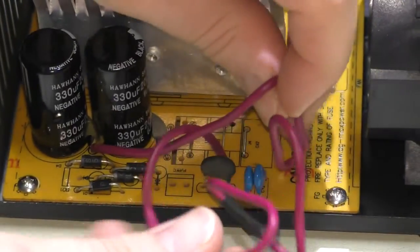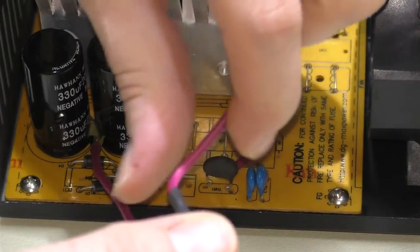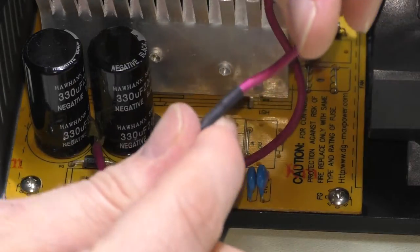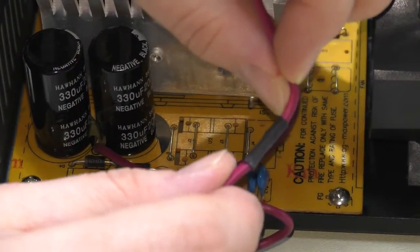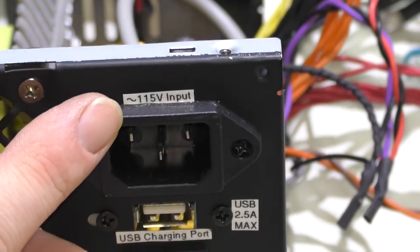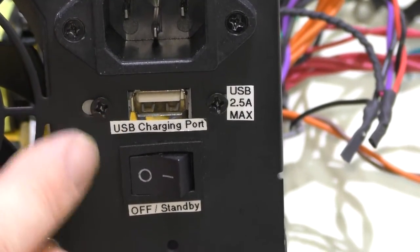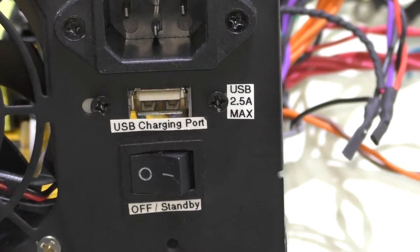On the other side, we can see this is the red wire that goes to the switch. Since I wanted it permanently switched on, I just soldered and heat-shrunk the connection here. But we'll break this connection and solder back to the switch so you can select between the higher and lower voltages — right now it's only set to 115 volt. The labels are easy to make — that's just a label printer.